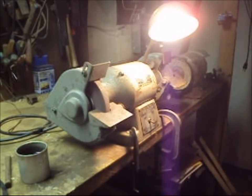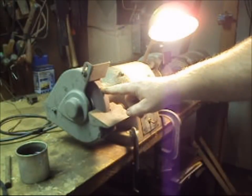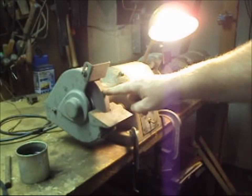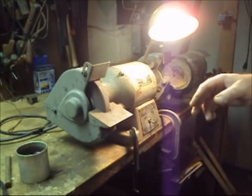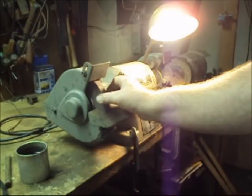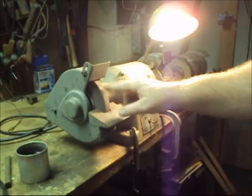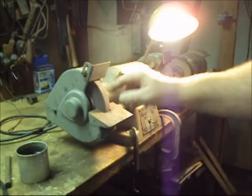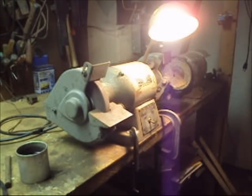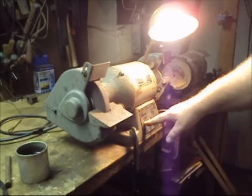A grinder is designed to cut on this face surface only. This kind of wheel is designed to grind on this surface only — never on the side. The reason is you don't want the wheel to thin out and lose structural integrity; it relies on the whole surface of the wheel to hold its mass together. If you grind a notch in it and weaken the wheel and a piece comes out, an 8-inch bench grinder wheel travels at approximately 60 miles per hour on the surface when running at 3,400 RPMs.